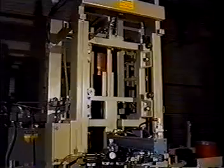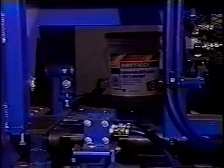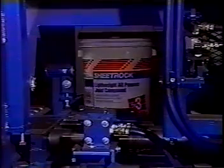We started with this hydraulically activated stacker because we feel that this is one of the most important aspects of the PASCO palletizer. You'll notice its rugged design, its ease of operation, and gentle handling of the five-gallon pails. PASCO ensures product delivery and security. This particular view of the stacker shows the stop and stacker which stops each pail and assures proper alignment of the pail as it is conveyed onto the stacker.